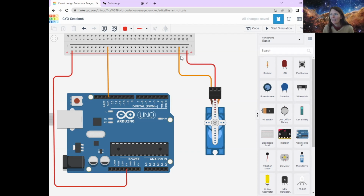So now that's connected. It goes in a circuit, so it's got its power and it's got its complete circuit because it goes from the ground along here, along this green highlighted one, all the way to this wire, through the motor, and then up through this wire to the power, all along the breadboard, and then down through the wire back to the Arduino. So we've got our complete circuit, which is a good step. We definitely always need that.